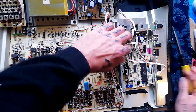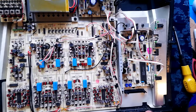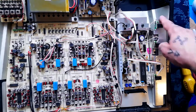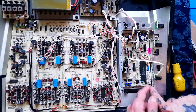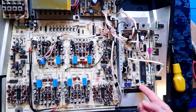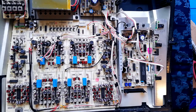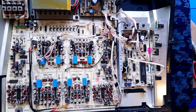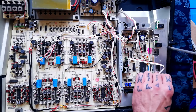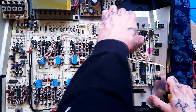I'm going to have a fiddle off screen, turn off the autofocus, and figure out what I'm doing. It looks like I might be wise to remove this metal plate — the chassis extension. There's a little tab here that's part of this metal plate that's going to prevent the board from coming out, so I'll remove the plate first. I'm going to leave the voltage regulators attached to the plate because if I unplug them it would be quite easy to mix up the cables and connect the 15-volt regulator to the 5-volt position. I'm also not going to unscrew them just because I don't want to replace the thermal compound between those layers.